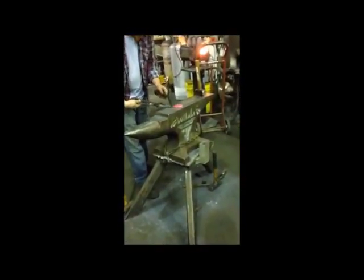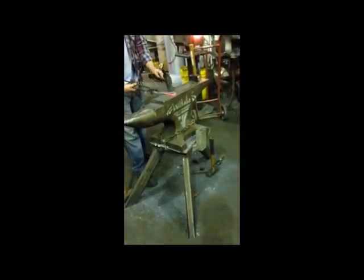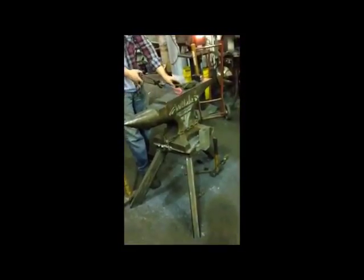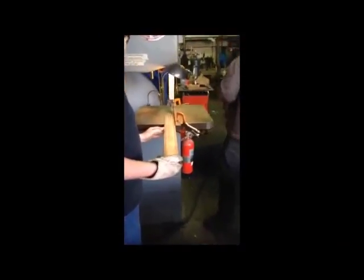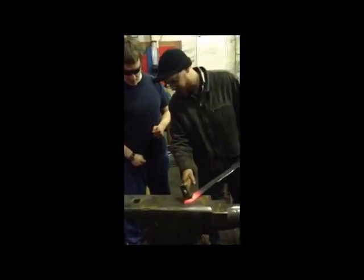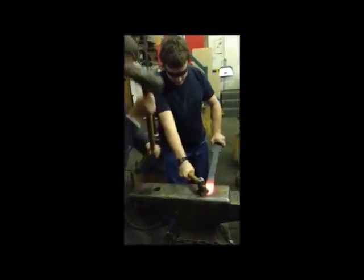These finishing steps are all about finesse. We were trained in knife making to learn the basic skills of forging. After the initial drawing was completed, the horizontal and vertical bandsaws were used to cut the metal to size. A sledge and a flatter were used in tandem as we worked our way down the blade to form the contours of the sword.